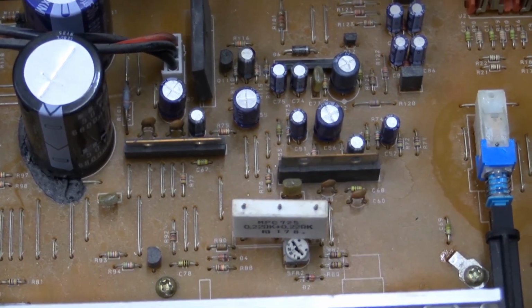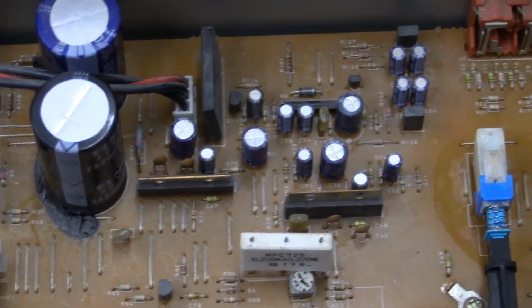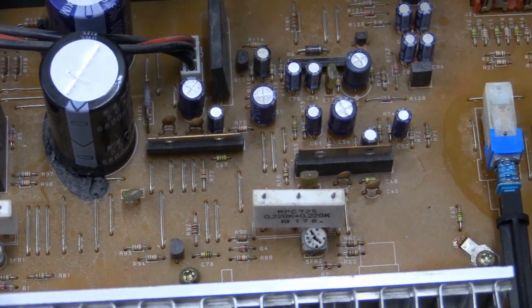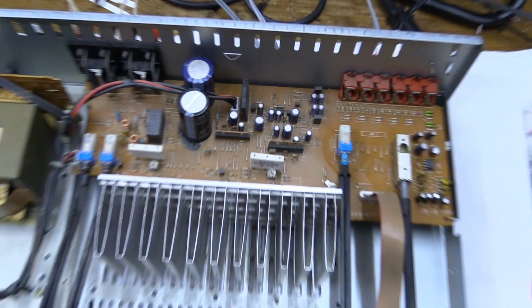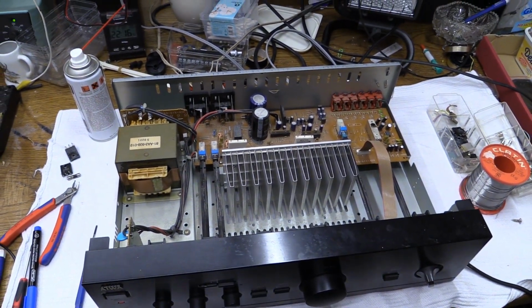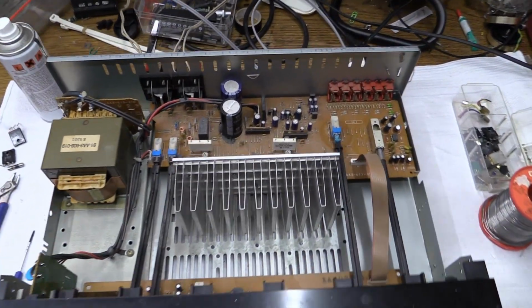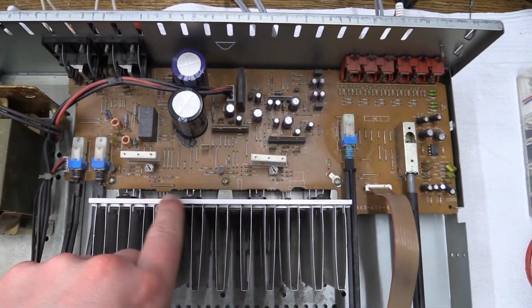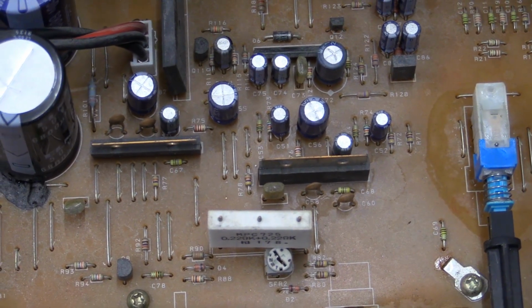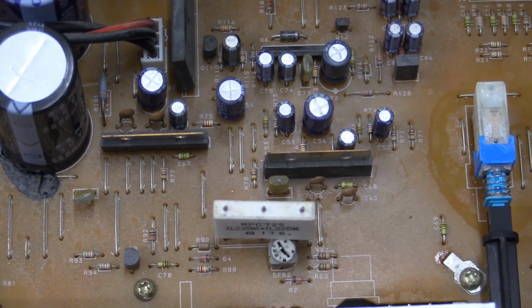It's all fine. Another thing is, as these things randomly make contact or don't make any more contact, they generate pretty massive spikes. And that was when I first turned on the amplifier, I got some pretty loud pops out of the speakers, and I already thought I may have blown them. So that may have caused the one channel to blow up. I'll definitely have to take this all apart again and resolder these ICs, because the way this is right now, the amplifier is not going to work properly.